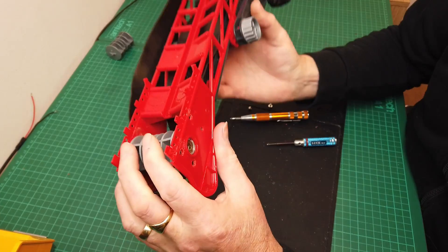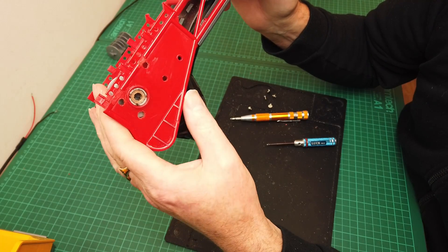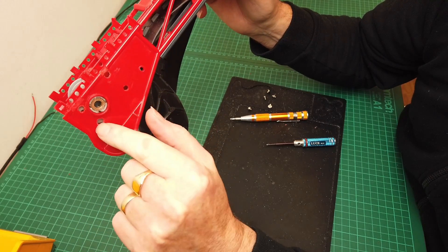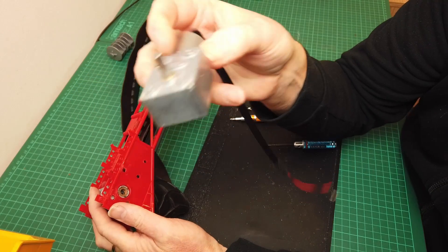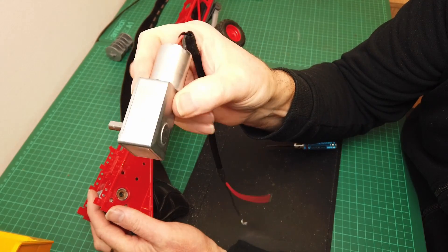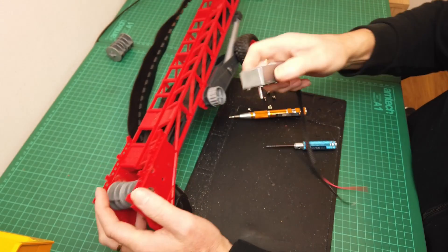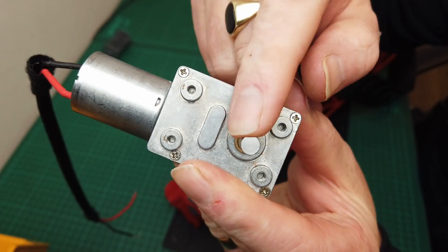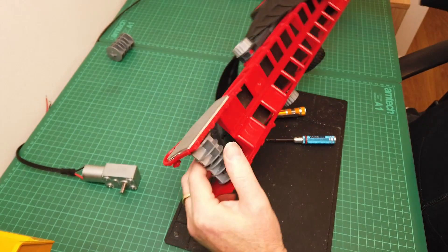What I've done is I've removed the handle that was there, opened up the hole a bit more, and fitted a brass bush in there, and drilled four holes for the gearbox mounts that go on to drive it. These are high torque gearboxes, really low geared, so I'm hoping that will drive the belt. The shaft has a flat on it across the top so the grub screw comes up against that and stops the shaft from spinning inside the bush.